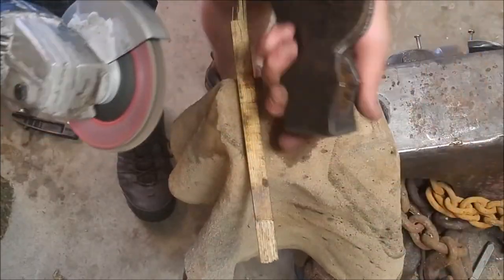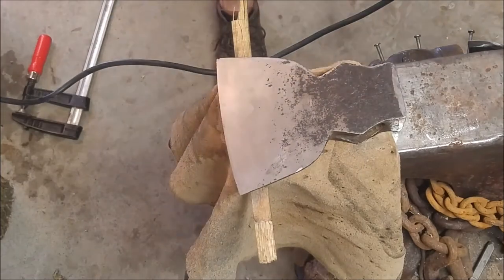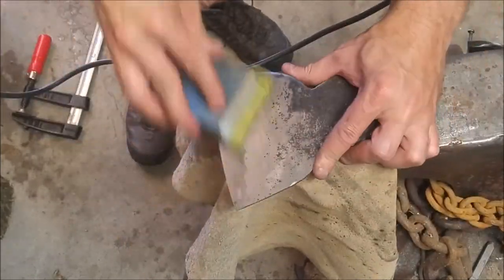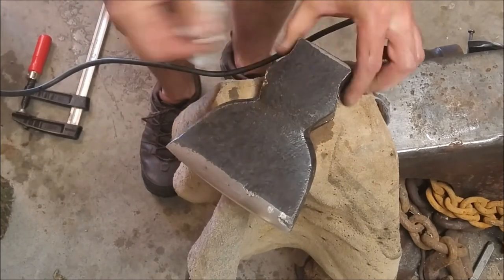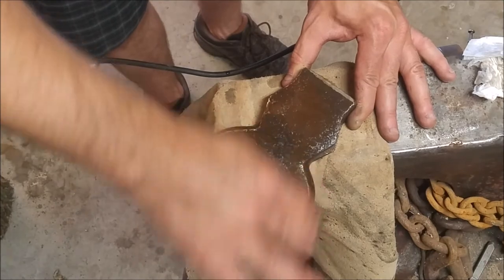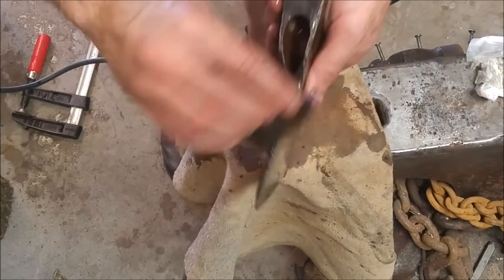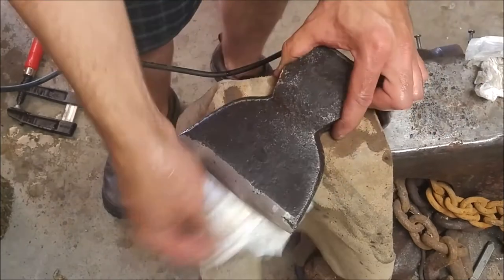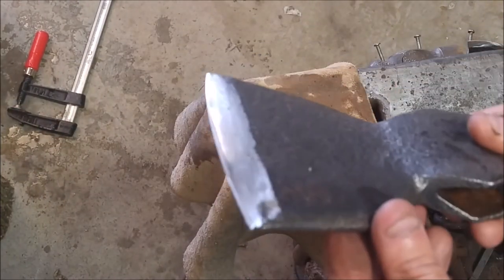So again a little bit of cleanup with the same flap wheel. You can see there's some rust coming off, so I decided to take some fine sandpaper and remove some of that rust — again I kind of want to preserve the look. You can soak these in vinegar if you like; it's acidic and will actually eat into the metal and remove the rust. The problem with that is it completely changes the look of the tool — a very matte, very uniform finish across the entire surface. So I prefer to preserve the look of these old tools if I can.